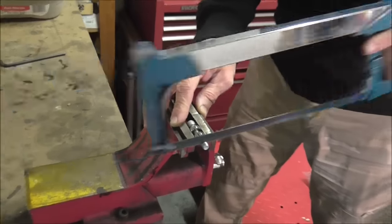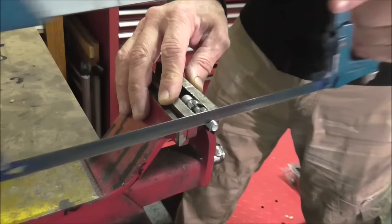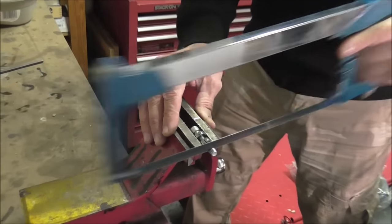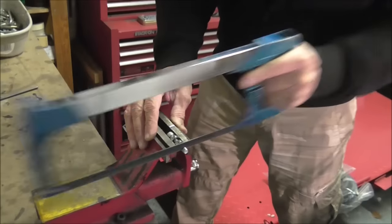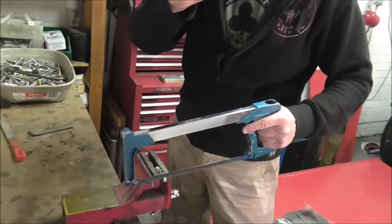This is where the patience comes in. Take your time, because you want the end of this bolt to be as neat and clean as possible. You could hack through it in about 8 lunges, but it will be a horrible mess. Use all of the saw — don't go a million miles an hour with the middle inch of the saw. The reason is that if you're going really fast, the blade expands, the metal in the bolt expands, and everything jams up. If you use the full length of the saw and go slowly, nothing gets too hot — it keeps cutting beautifully and you get a nice end.